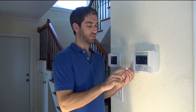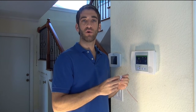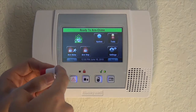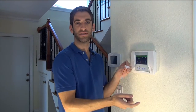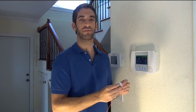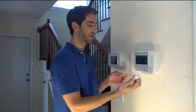So that's how the 5800 RPS works. One piece of note: we normally like to recommend the 5800 Micra or the 5818 MNL if you're going to go with a wireless recessed sensor. The reason is that when the contact and magnet work together, it's more reliable. This plunger switch, because it is on a spring, after many activations — maybe thousands — it may eventually stick, so when your door opens, it doesn't pop out the way it should, and your zone would not know the alarm went off. It is reliable, but if you're looking at recessed, we would urge you to consider the 5818 MNL or the 5800 Micra instead. If you are going to go with the 5800 RPS, we're going to show you how to program it now.